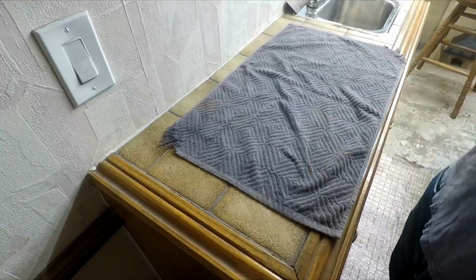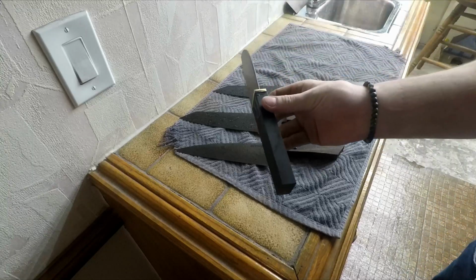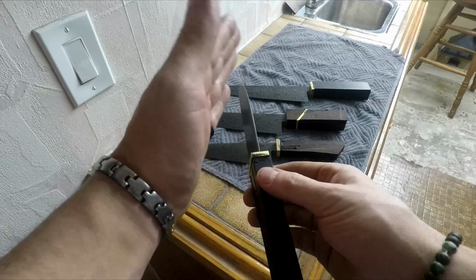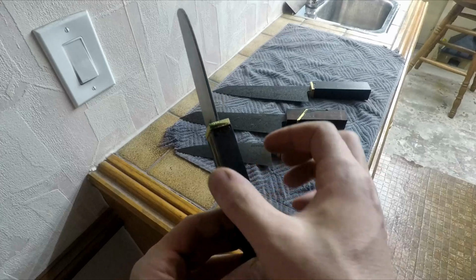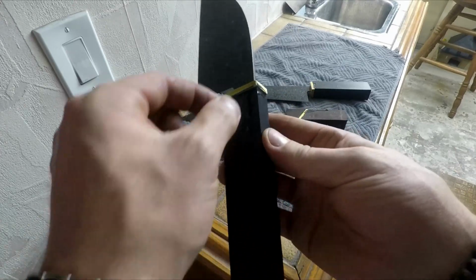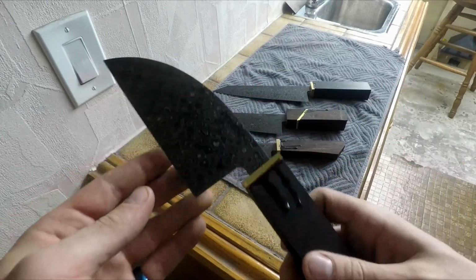Damascus knives are finished glue up. The Christie and the 2 Stellas turned out fantastic, and Debbie decided to take the day off and get drunk. As I was gluing it, the blade leaned to one side, and the epoxy set with a pretty nasty angle of the blade compared to the handle. And with how thin this is, I'm not going to be able to correct it with grinding because it will expose that internal channel. So I'm going to have to grind this off carefully without damaging the blade and start over.